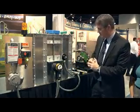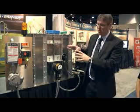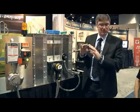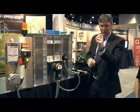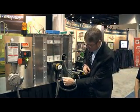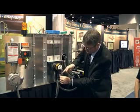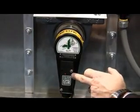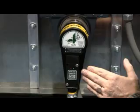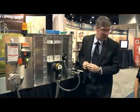This device is mounted on the shaft. First of all, you must make sure that you do not introduce any material into the elevator. Make sure that the belt is tight and everything is running normally — the belt is not slipping. We then take the magnet which comes with the M800 whirligig and calibrate the M800 by placing the magnet on the calibrate area. The green light starts to flash, showing us that we're calibrating. The green light will flash back to verify that it's calibrated and will come on steady. The red light is flashing continuously — this is each time it's detecting the target on the shaft.